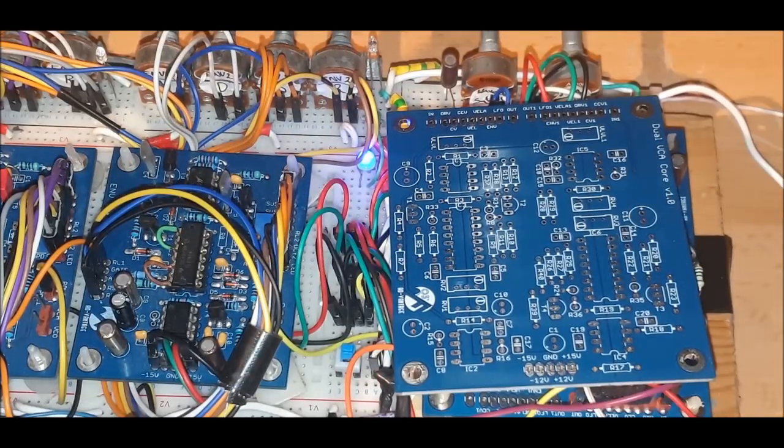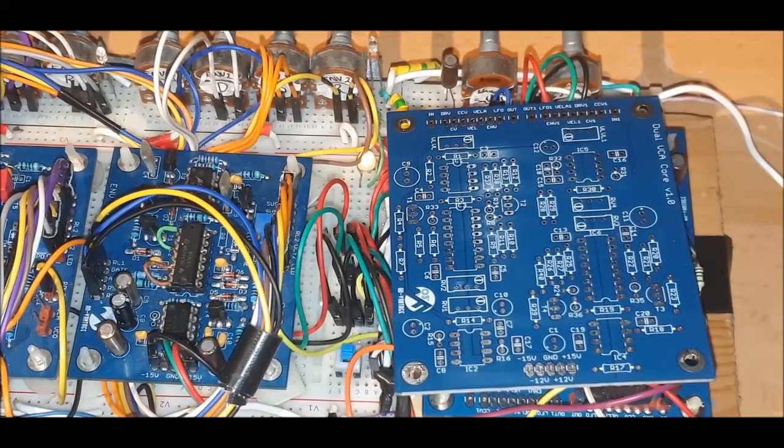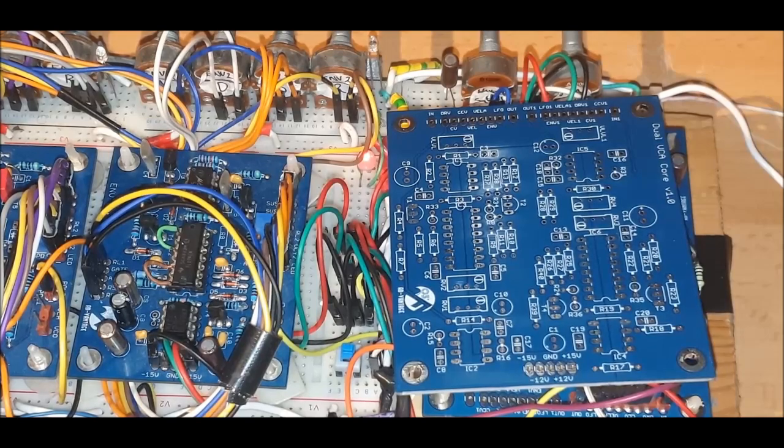As opposed to a discrete design, you can distort them, but they distort nicely. These ones go into quite harsh distortion and don't sound too great, to be honest with you. So I had to be careful. Say for instance you're doing a very big high pass resonance sweep through, and you get a massive peak boost from the resonance. It gives you a fat sine wave, and it tends to distort.